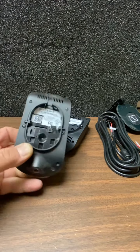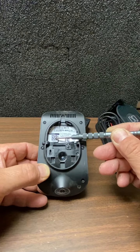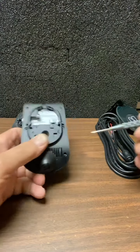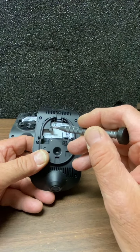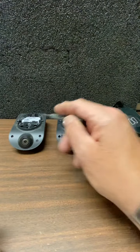Appearing to the left, we have a Nauto N2 camera. How can we tell it's an N2? Number one, the QR code is on the bottom left, and the notch is always on top — this is an N2. On an N3, the QR code is on the right-hand side, notch on top. Also pay attention to this little screw and this little piece up here: N3, N2.